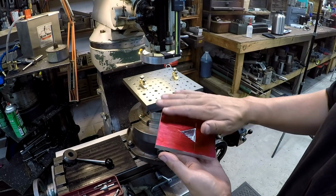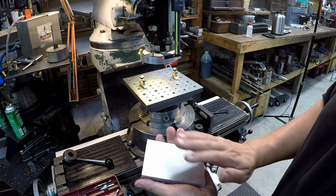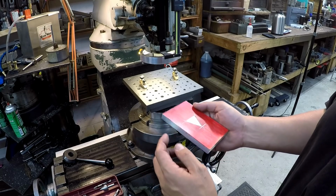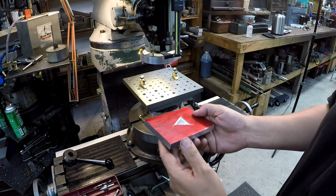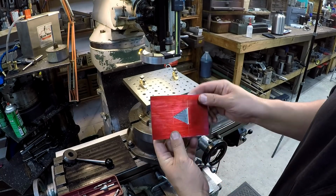We're going to use our shear tool to do that, but yeah, we'll do our drill and tapping, shear cut top and bottom, and then after that we're going to use a radius tool in the shaper also. I want to try a radius tool and cut all these radiuses on the corners versus a standard milling operation with a corner round. All right.